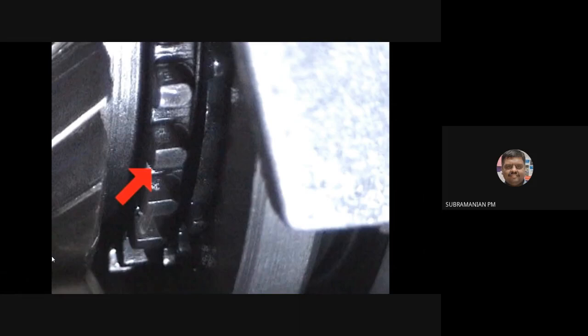Now see, it is going to move. In the first initial movement, we take the speed from the gear. That is, the frictional surface will come into contact. It will gain the speed. Then with further movement, the teeth will get engaged. Then it will take the motion from the gear and transmit it to the output shaft. You can see the animation now. It is not animation, it is a working, okay? Now see, it is engaged, okay? Teeth are getting engaged.